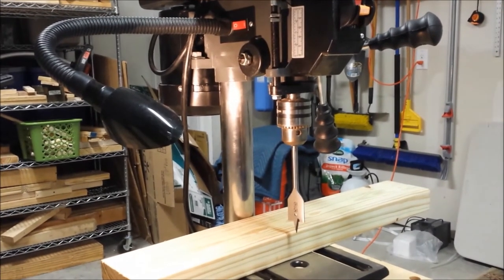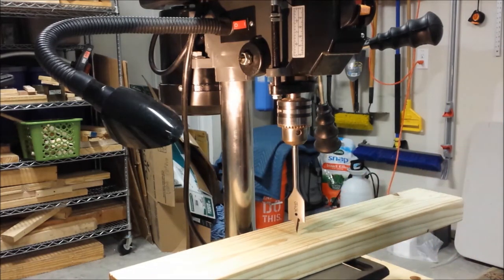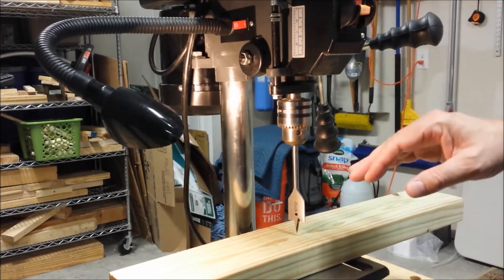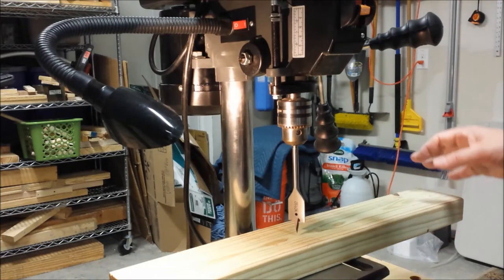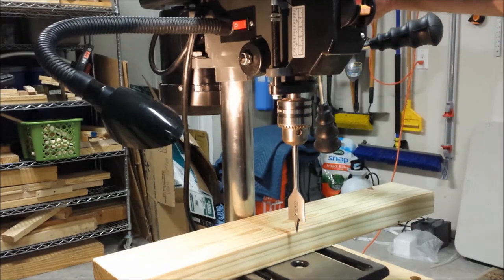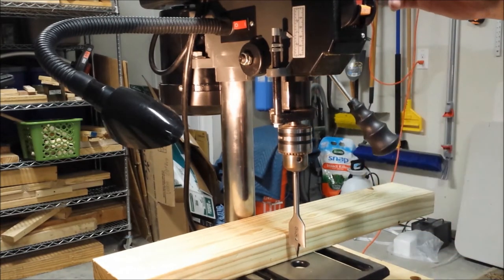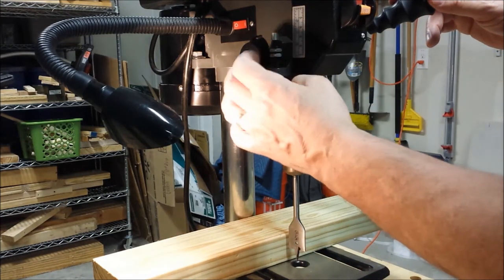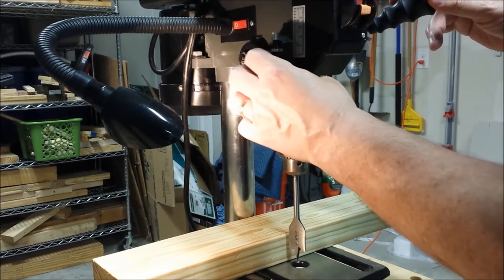I've zoomed in a little bit closer so you can see this. The first thing you're going to notice is that I have the drill bit just a fraction of an inch above the wood, so I've got to bring it down just a little bit to touch it. The reason I want that is when I turn on the drill, I don't want it to immediately start tearing into the work product. So I make sure it's about that height. Next, I'm going to move the workpiece back, then take the handle and bring it down. I'm going to show you how I did the punch-through. I bring it down to about that far — all I did is take these little nuts here and bring them down to right there.